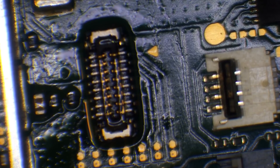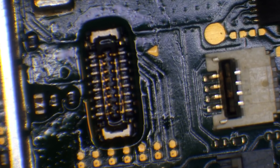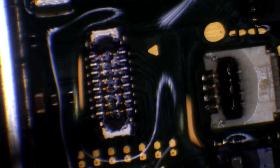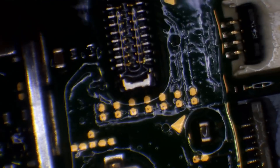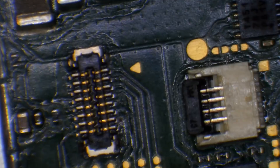I don't want to clean the flux off until it's a bit cooler — putting room-temperature isopropyl alcohol on a 200-degree Celsius board would be rather silly. The board should have cooled down enough now. As you can see, it's still fairly warm, the isopropyl alcohol is evaporating quickly — we just don't want thermal shock. I'll dry off the remaining isopropyl alcohol with some warm air. Visual inspection: tilting it on an angle — that looks absolutely spot on.